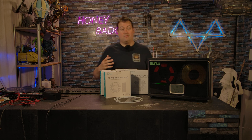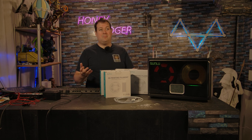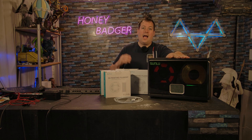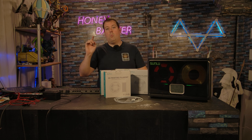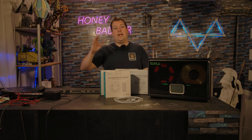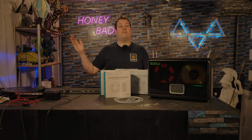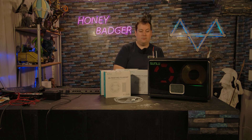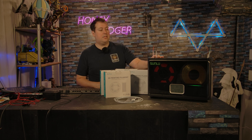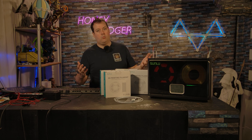All in all, this machine does a really good job at what it's trying to do. We've had filament dryers before — they're normally just a container with some desiccant in them, and frankly they're underwhelming when it comes to actual results. This actively heats and has target humidity levels. You can do two modes: mode one is where you simply dry the filament for a set period of time; mode two is where you dry it for a set period of time and then any time the relative moisture goes over 50%, it will kick back in and bring it back down. You can set it as low as 30% humidity, but it will actually try to get the chamber all the way down to about 25% before it starts to shut off automatically — so it's much more efficient than just running it all the time.